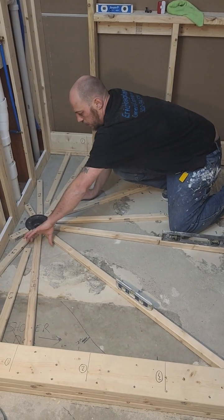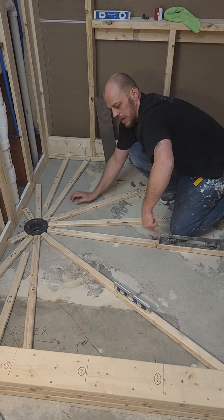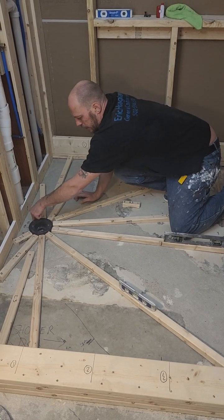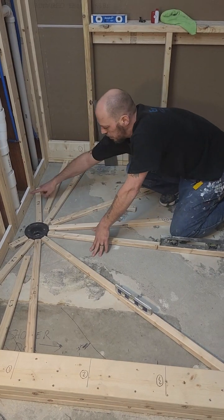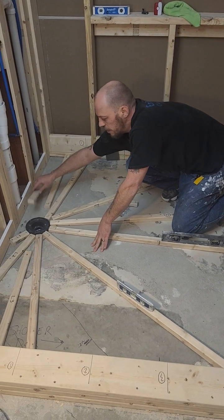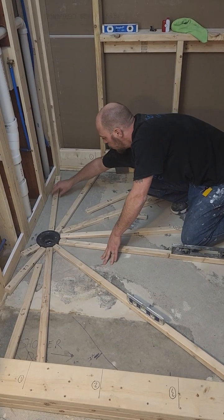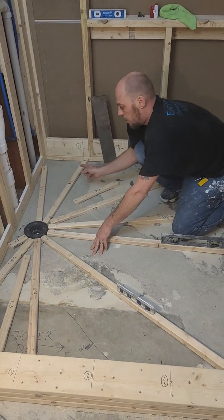Once all these are gone and away — we just did that — we would actually leave this one in play. We want to work this side first so I can be closer to the curb finishing, so I would remove this one, which made a line here for my original guide. That is going to be my new guide, plus the next one in line, to stick my small trowel in there to get that pitched over to perfection. Then this one would come out, so on and so on. There's my line — this one would slide up into place and go over to my mark, and we would do this one and then so on, working this floor all the way around.